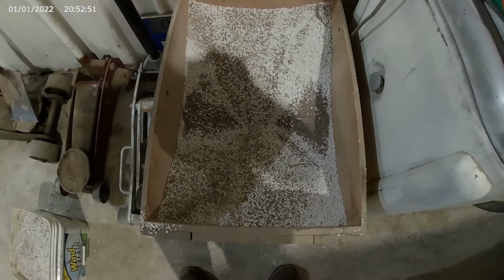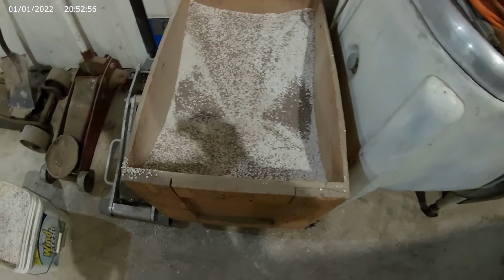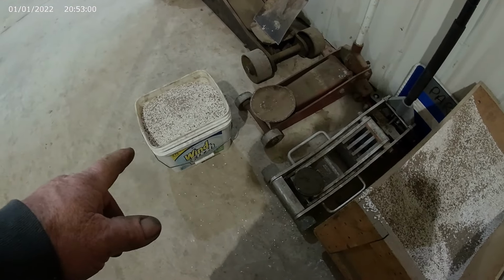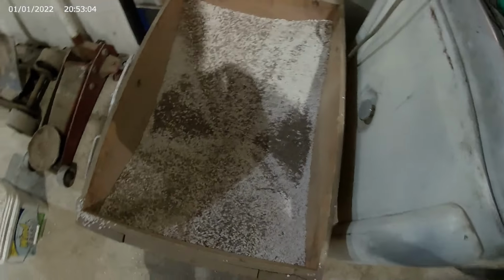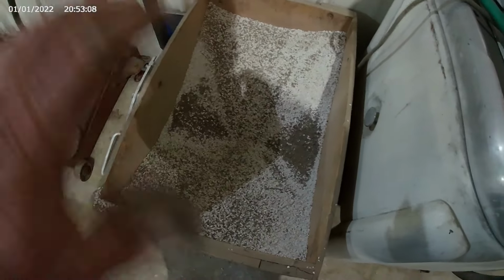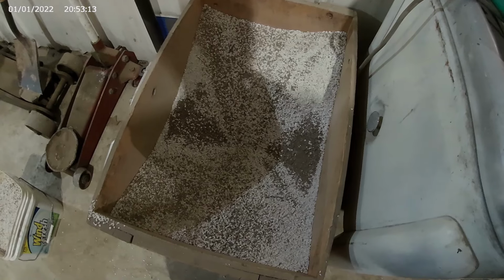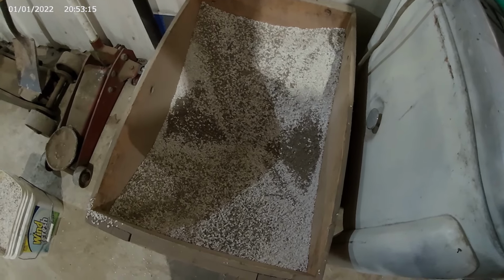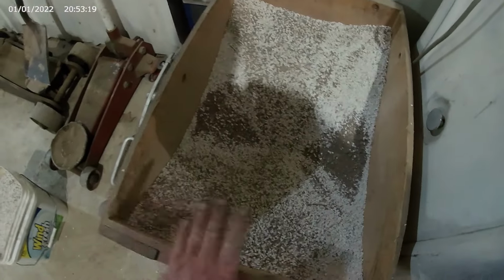So what I have here is a great big wooden box full of oil dry, and then I got another bucket of oil dry here. When I get done welding it, I'm going to lay it down here in the bottom of this. I'm going to take that bucket of oil dry and smother it so that it's in there about 6 inches deep. And that'll let it cool off real slow. So immediately when I get done welding it, I'm going to throw it in this bucket of oil dry here and cover it up.